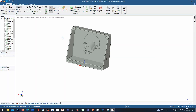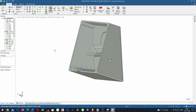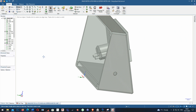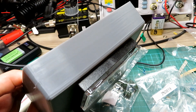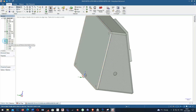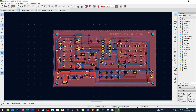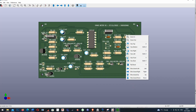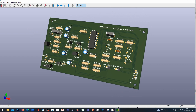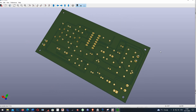I started with the circuit board design. I wanted to use the same case as the old orange meter but remove some of the things that take time, like board mountings and logos. I also wanted to address the main shortfall of that meter — the range. The meter itself doesn't match the rectifier circuit so the span of adjustment is right at the top end; still useful but not ideal. I designed the board to be the same dimensions so it would slide into the case, and the board would be two-sided to enable decent component spacing.